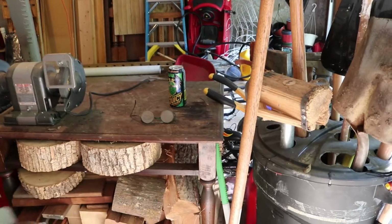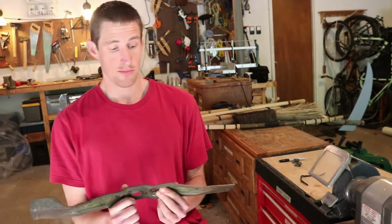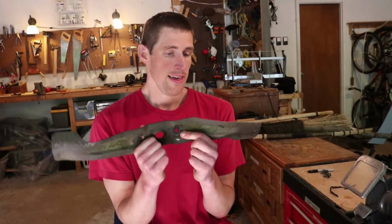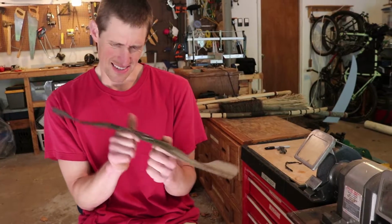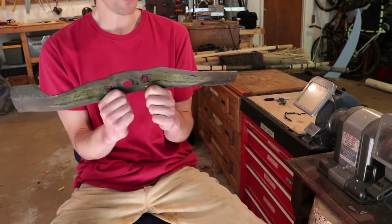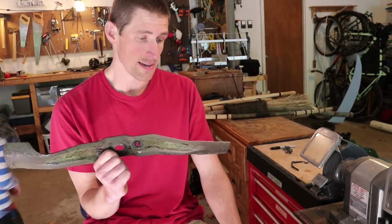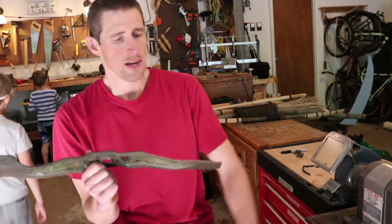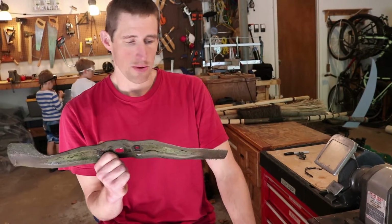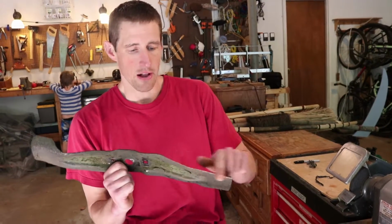As I said, I don't necessarily know much about lawnmowers or lawnmower blades. I do know that this kind of blade is probably made from a simple kind of spring steel. Maybe it's stainless. I don't see anything on it. But for sure, this blade prioritizes toughness over hardness. And what that means is that if I tried to get this to a razor edge, it would get dull pretty fast. Probably within one mowing, it would get dull. It would kind of stabilize at a certain dullness.